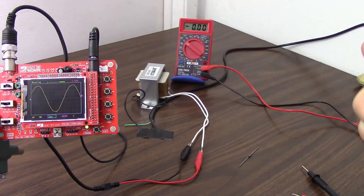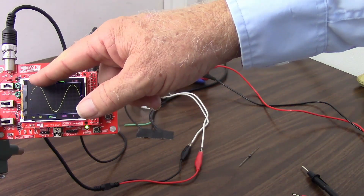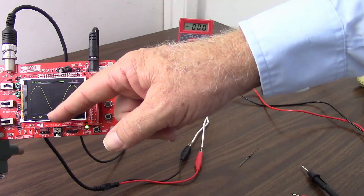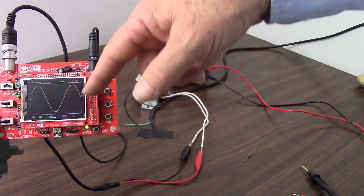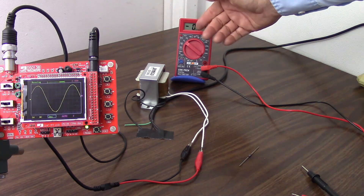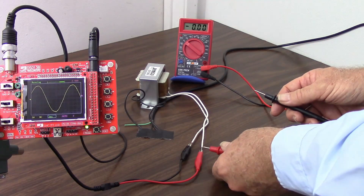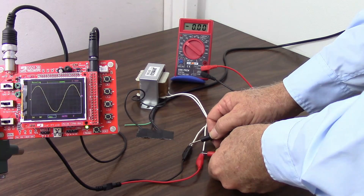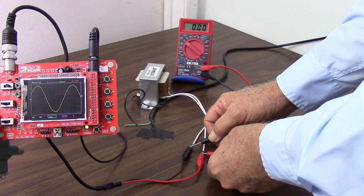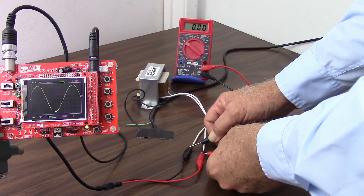And there is our sine wave. It is 12 volts RMS, going to positive 16 volts, down to about negative 16 volts, back up to positive 16 volts, repeating that over and over 60 times a second. But if we look at this with our meter, which I now have set for a maximum of 20 volts DC — it's set to read DC volts, and because I have pure alternating current, I see nothing.